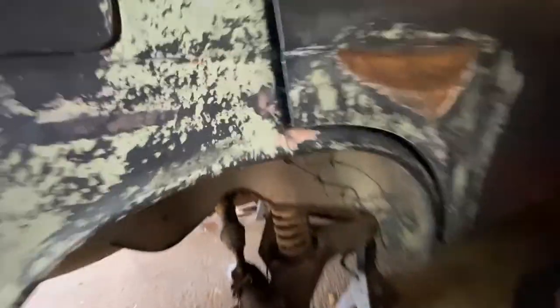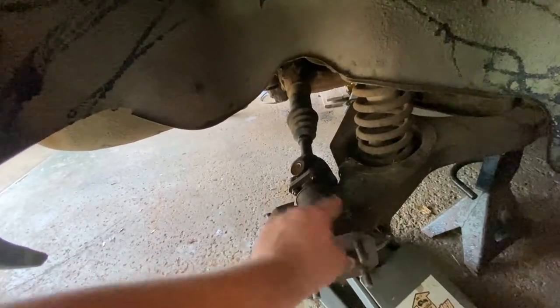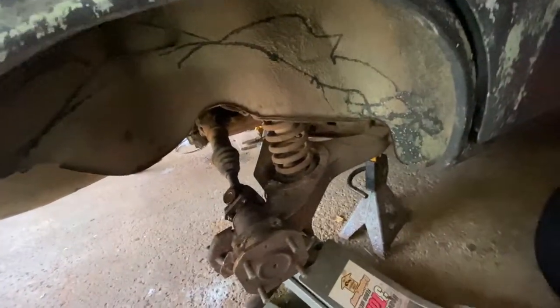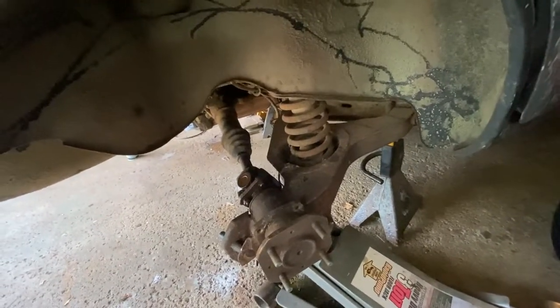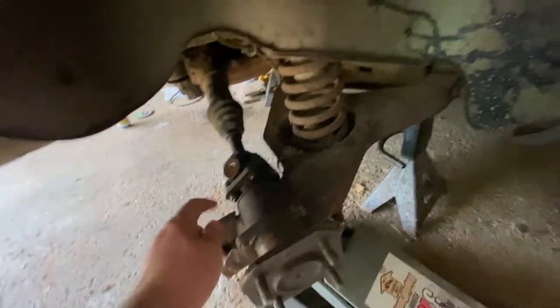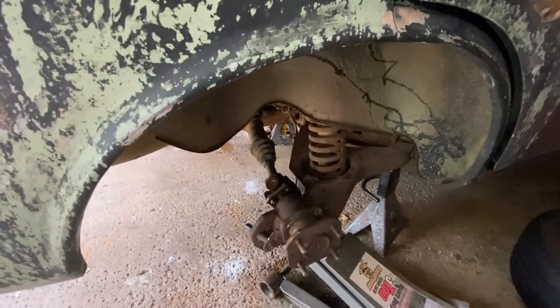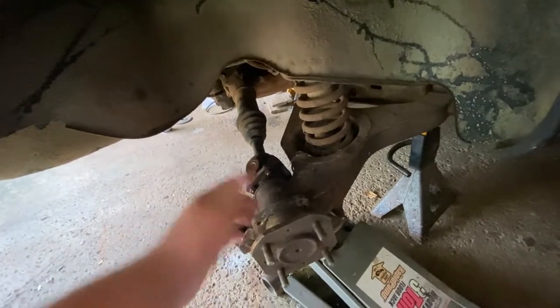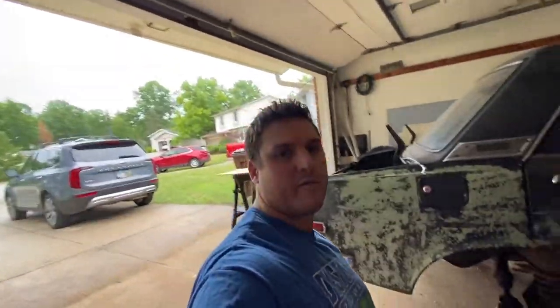I plasma-cut the back shield off to get it off because you have to mount the bracket there for the rear brake. I'm running out of time today, so I have a buddy coming over to help and I won't be filming it all. I moved the shock already and need to get the spring out. I have to disconnect this to make the arm drop lower to get the spring in. I'll catch you guys up afterwards once I get the suspension set up and brakes installed and bleeding taken care of.